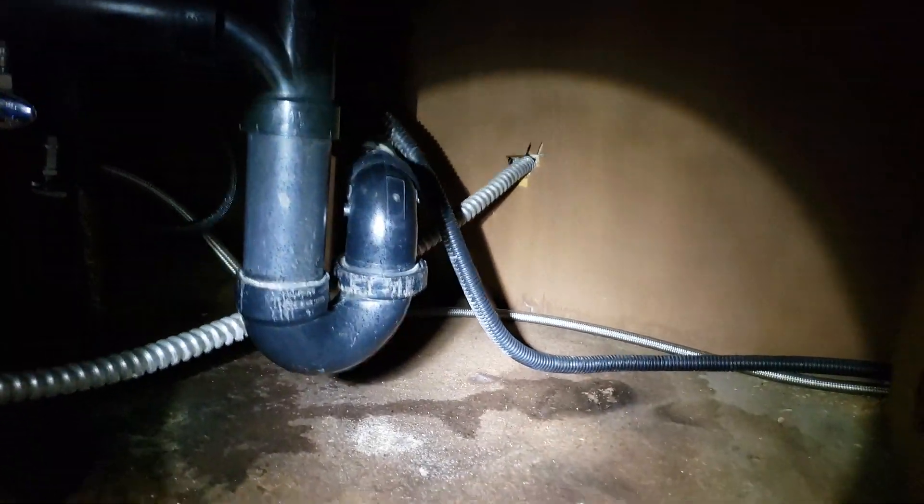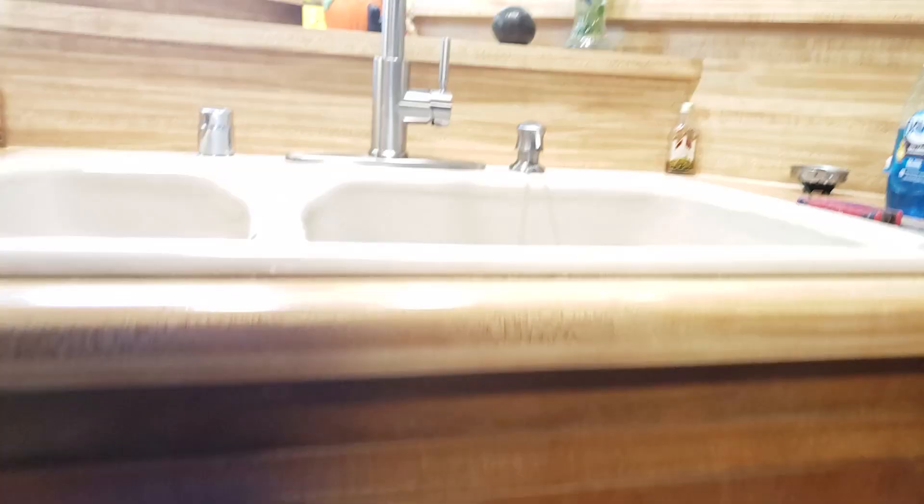Just monitor those areas as far as drainage piping. Make sure it's not leaking — you can see that nut's been hammered. Someone's had a wrench on that just over and over again. You don't need wrenches on those; they're all finger-tight. Monitor the sewer line — we don't see any leaking from it. We didn't see water dripping off the trap or off the tailpiece or these nuts. The faucet's in good shape since the installation is done.